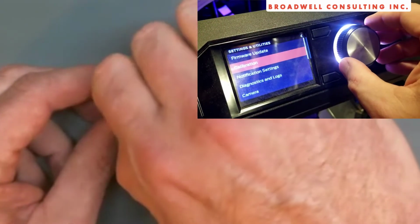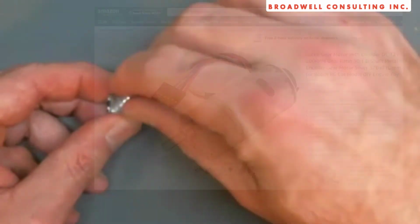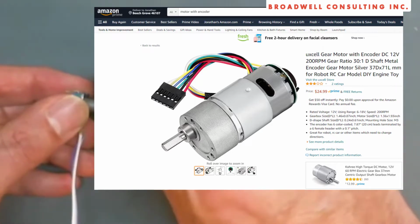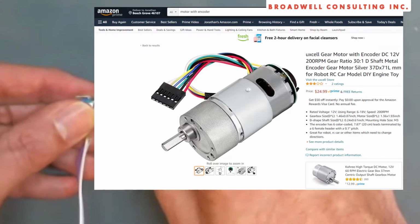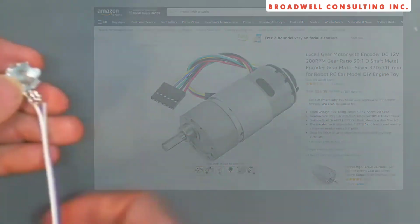Typically these knobs have ticks on them that you can feel, or detents. The other application that you see sometimes is as motor measurement devices, where there'll be some kind of spinning shaft, and the encoder will be attached to that shaft or attached via a gear set or a pulley or whatever to measure the number of turns of that particular motor.